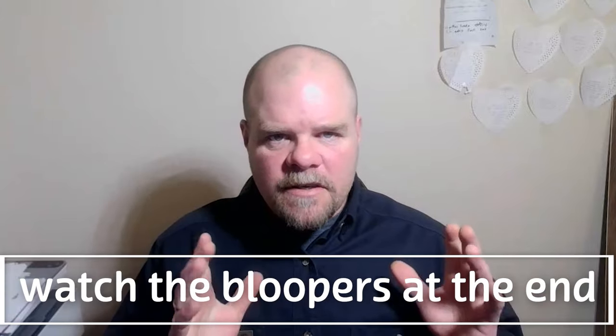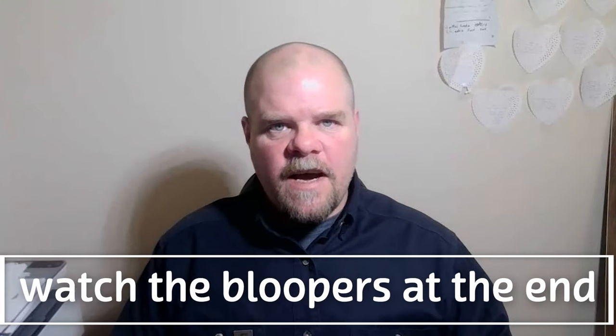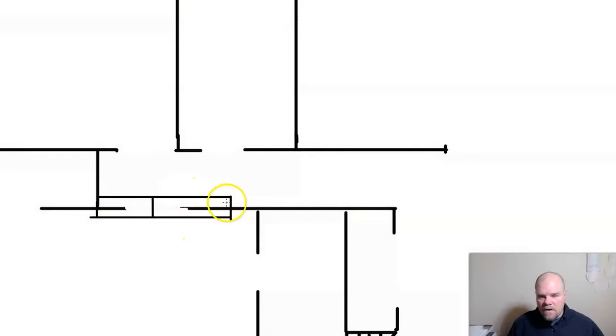You can see how beneficial it is going to be for you to base your installation off of the hallway. It's going to give you the best look down that hallway where you have the same size plank on both sides. For long skinny hallways, it's just going to look fantastic, beautiful, professionally done. You're also going to avoid having issues where you don't have a plank running on both sides of a wall through a door jamb. You're going to be able to end a plank somewhere in the door jamb — that's going to really help you. Now you know what to look for.